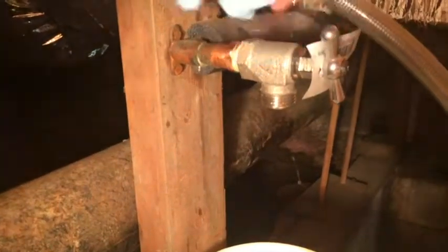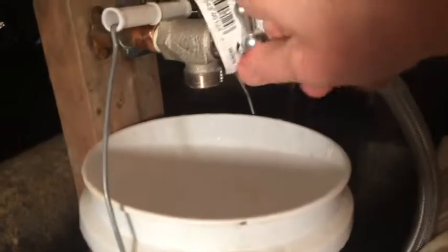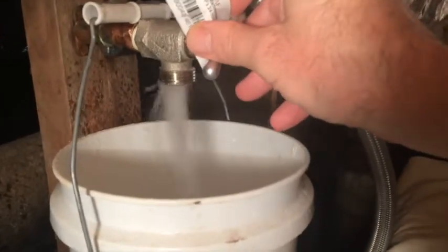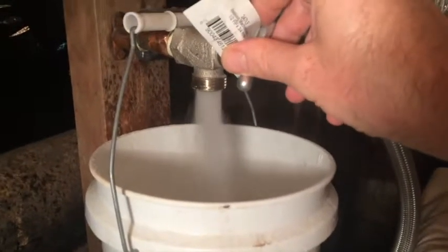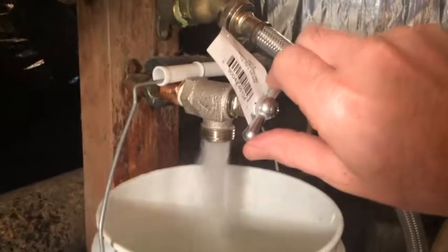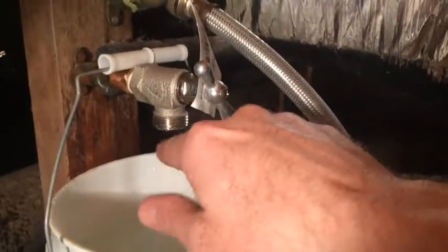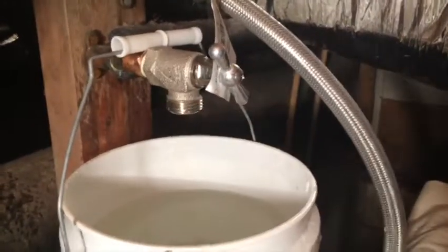It's good to wipe any extra crap off of there. I'll use the bucket here to get some of the air out before it gets hooked up to the washing machine — get some air in the line, no doubt. Oh look — you know, that's the hot water. I thought I was doing the cold supply. That's why it was dripping the whole time.